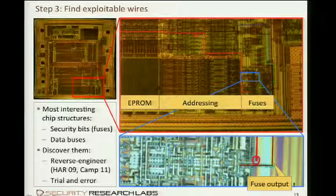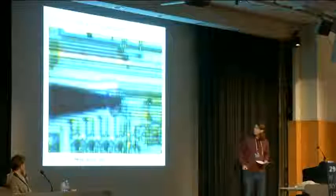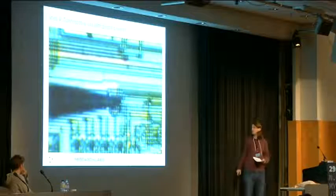And this image here was taken by Kristanovsky, but I received it after I found the fuse, so I really can confirm that I found it by myself. This is the view through the microscope. This is what the attacker sees. The image is a bit blurry. It's taken with not that professional camera. The human eye sees a much better image, but you see the needle. The needle here is a blurry shadow. You always see the shadows that the needle is throwing on the chip's surface.